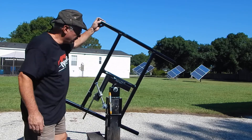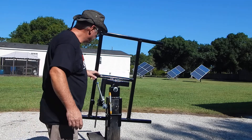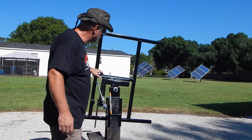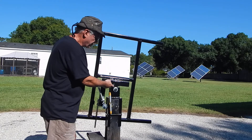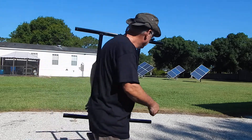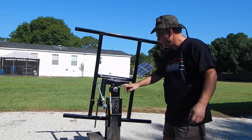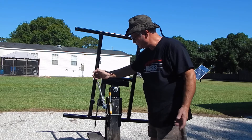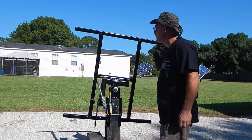That's nice if you have a wind speed sensor. When I ship these out, this pin will be installed — or it may not be installed depending on how it fits in the box. There will be a grease fitting here, and it will be all pre-greased. Make sure to grease this area and inside here on both sides, as this is where it's going to go up and down, so you want that to move pretty freely. Put some grease on your bolt — it's zinc plated, so it should be okay. You can put some penetrating oil on there if you'd like.